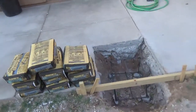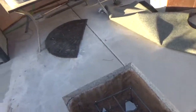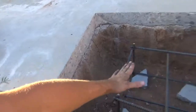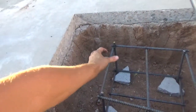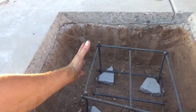I'm gonna go ahead and get another pallet of concrete and a mixer. I'm gonna do three different pours, so it's not gonna be monolithic. The reason being, where the column is going has to be three and a half to four inches up above this, and it calls for a half-inch gap with cork board. So the only way I can do that is by pouring the footing first.